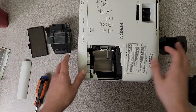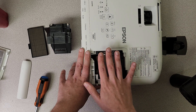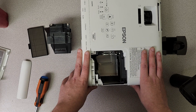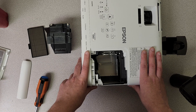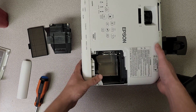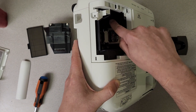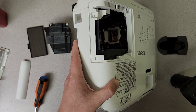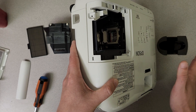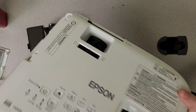With the power of movie magic, we're back, and we have the bulb compartment open and the lamp removed. What we're really going to be looking at here is the airflow around this lamp, and that is going to be the big cause of most issues with these projectors. If you notice your lamps are getting dim quickly or your bulbs are going out quickly, this is probably the reason why — especially on these units that take the 96, as they're all designed similarly when it comes to their airflow.